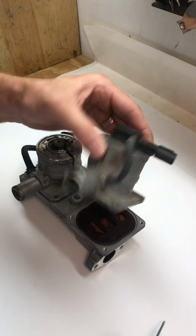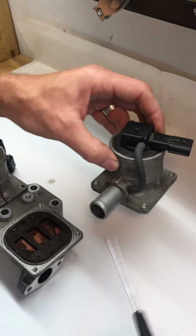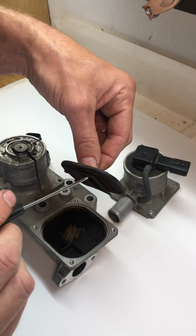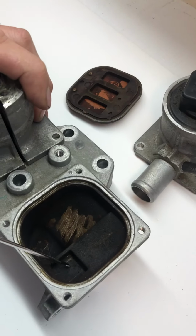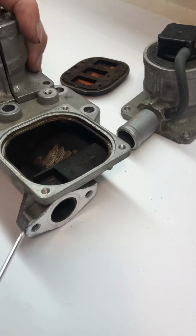and take it apart. This is the valve. This is a plunger that comes down when it is energized. Air would be entering through here, goes through these little small baffles. Then the air collects in here, down inside this little tray, if any sediments, and then out into the exhaust in here. Okay, so that's what one looks like right there.